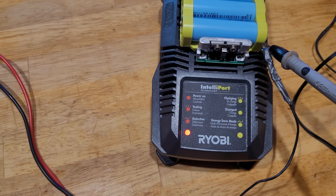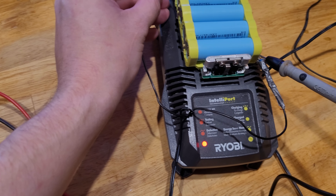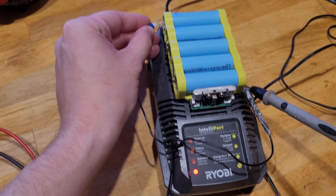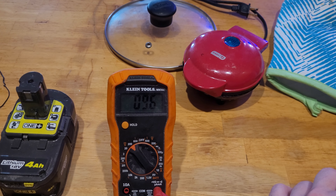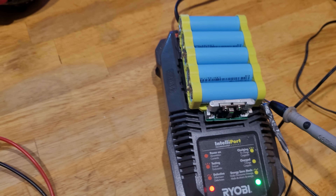Here's the trick. I've got the ground side connected to the ground side of the battery pack, and we've got a red blinking light showing the defective battery. Now watch — I'm going to touch the red, which is the positive side, and now we're charging. Just to verify that we're charging — look at that: 9.6, 9.8, 9.9. We're already up to over 10 volts.